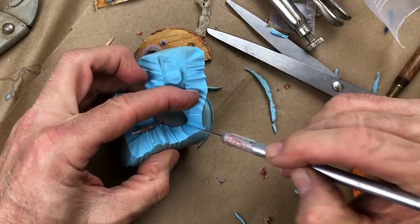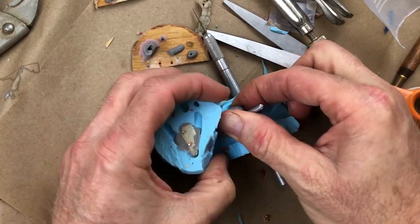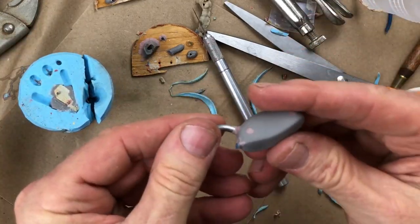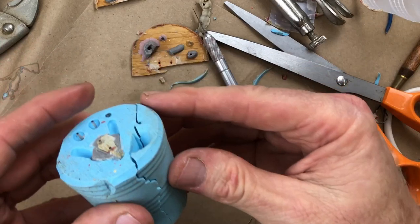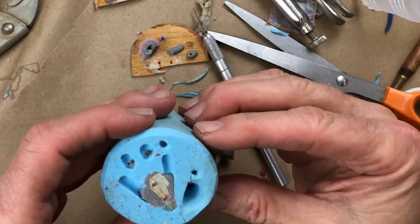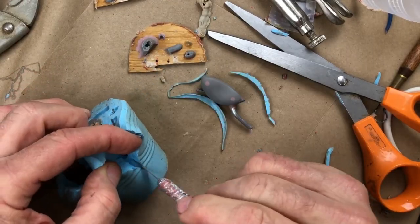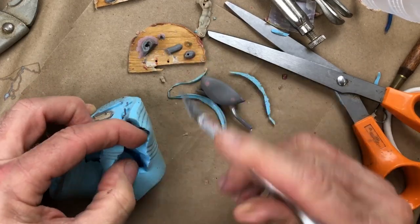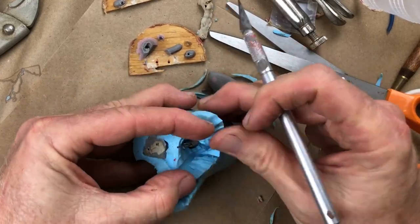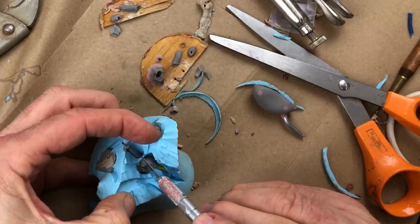Let's see if we can't free that part now. The head shape came out just fine and it's actually in pretty good shape — that mold is going to close right up very nicely. The whole trick to doing complex molds is to have a very clear idea and a clear plan as to where you're going to cut and why. I have a completely clear vision of where I'm going as I cut this mold open and what I need to cut to release the piece.